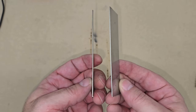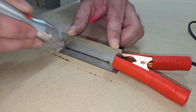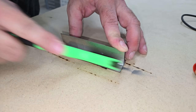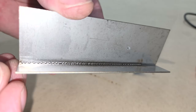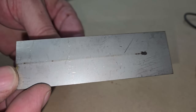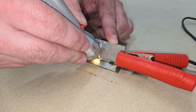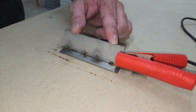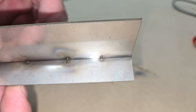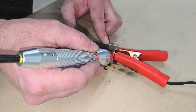Next, I spot welded two pieces of stainless steel. In the second attempt I tried traditional spot welding, but I fired the torch for too long with too much power and ended up burning clean through the material. But that just means it has the potential for good penetration — it's just a matter of using the right settings and speed. Next, I tried running some continuous weld beads by moving at a slower speed to overlap the pulses, which worked out really well.